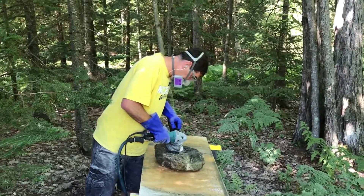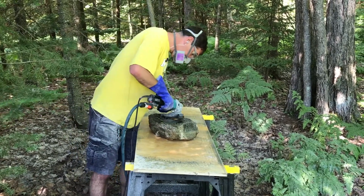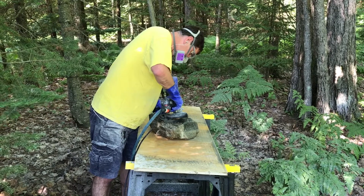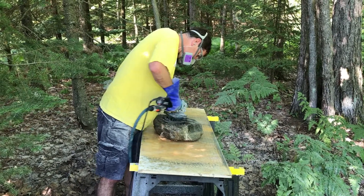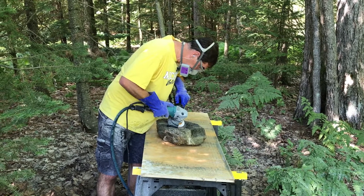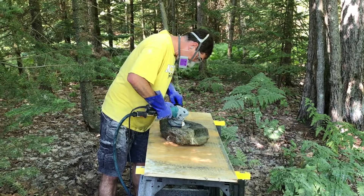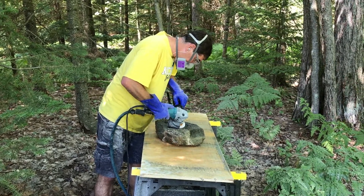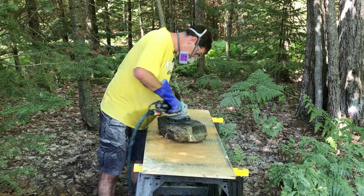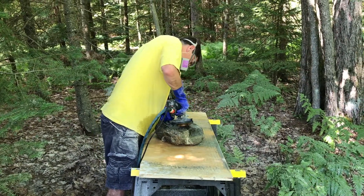Here I've moved on to the wet grinder with the cup wheel on it again. This stage took a really long time. You've got to really work at getting into those tight corners with the grinder — it's a little bit hard to get in there. When I get done with this, it's still pretty rough, and then I move on to 30 grit with a soft backer, and that starts to smooth things out.